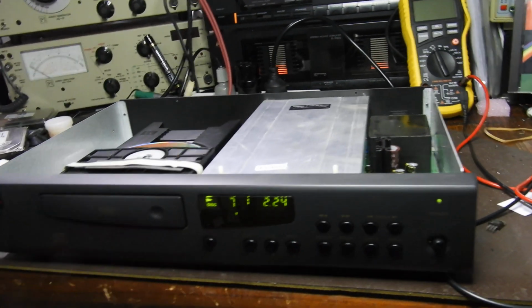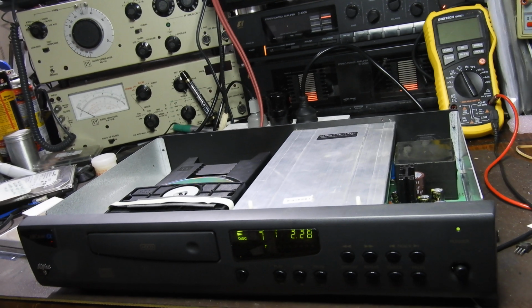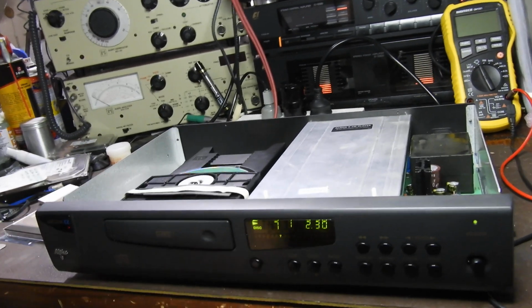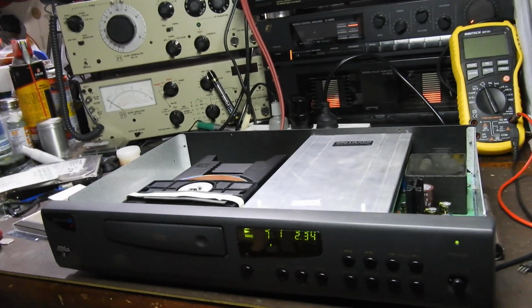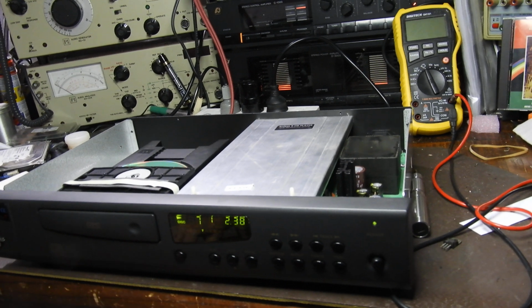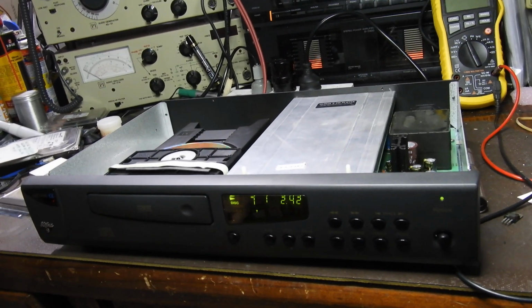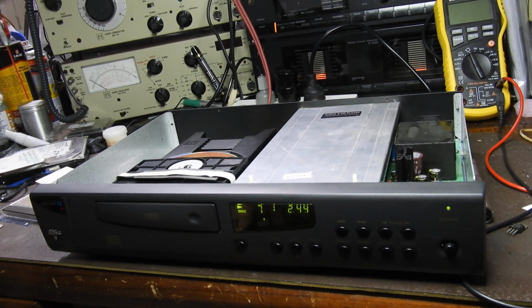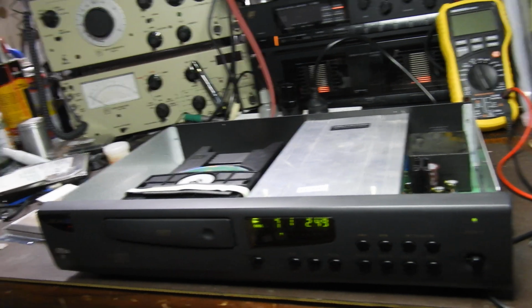And somebody was audiophiling, fitting. I've seen some Oscons, and I don't remember if Nichicon or Rubycons. I have to check which ones they were. And I think they forgot to fit a heatsink on that regulator, and without a heatsink it got fried with time. So now it has a proper big heatsink, so it should work fine.